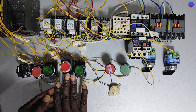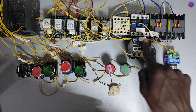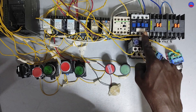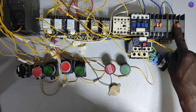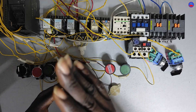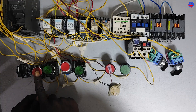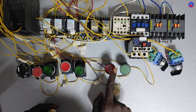So this is pump 1, pump 2, and pump 3. Pump 1 is 25 horsepower, pump 2 is 5 horsepower, and pump 3 is 15 horsepower. The project says that always 2 pumps should be running whilst one pump is on standby. Always pump 1 should be started first, and then any one of the other two should also be started alongside it.